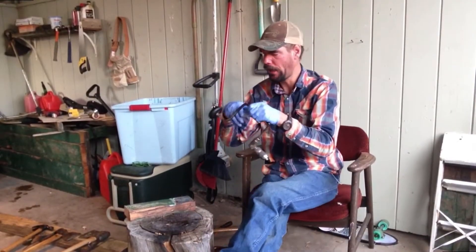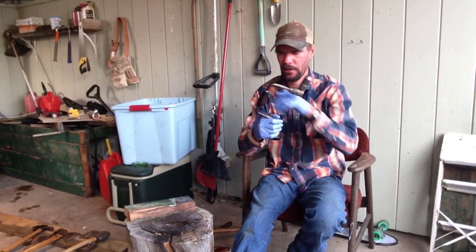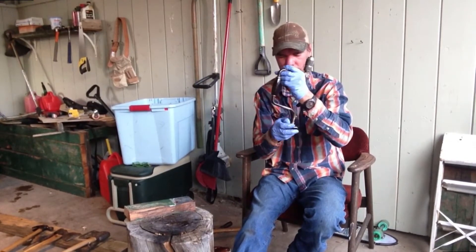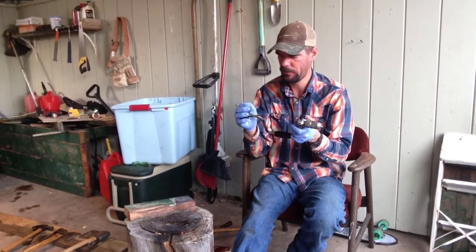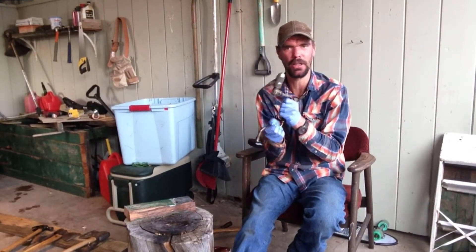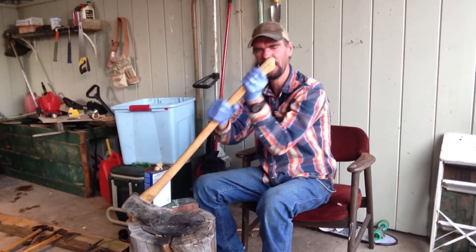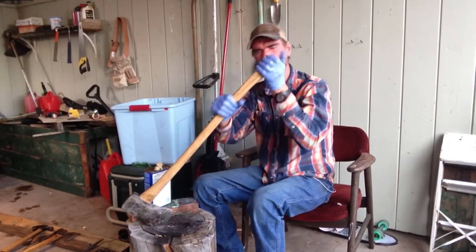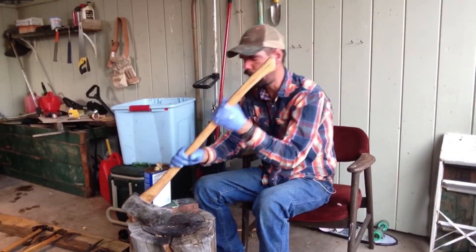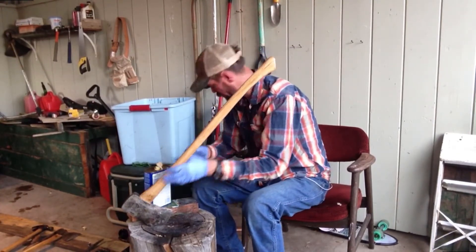These antique tools — once these handles crack and break, they're gone, they're not coming back. So I oiled this one not too long ago, so it's pretty good to go. I don't know of a chemical out there that provides as good of a grip. It's not sticky, not gummy — just a really good feeling grip from this boiled linseed oil. After you've had some use on it, it gets polished, it gets this beautiful deep brown patina. It's just wonderful to work with.